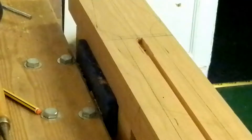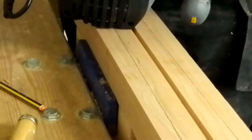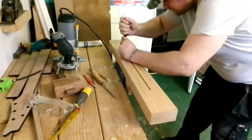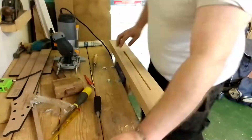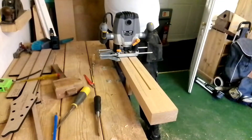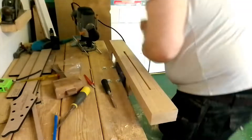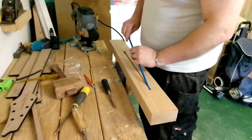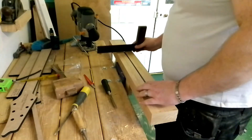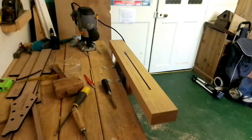Next week I'll be gluing on the fretboard, shaping the neck, putting the tape down the neck, and sorting out the break angle for the headstock. It's quite a steep angle — this is a 50-millimeter neck blank and it actually goes past the 50-millimeter point. So I'm going to reduce the angle of the headstock a little bit so I don't have to do a scarf joint — not that I couldn't, I just didn't plan to do one on this build.